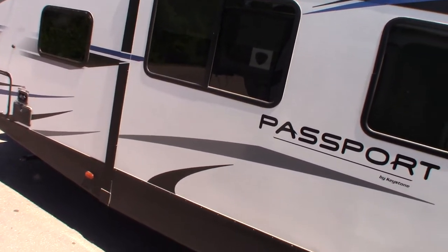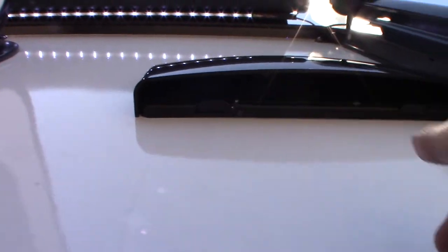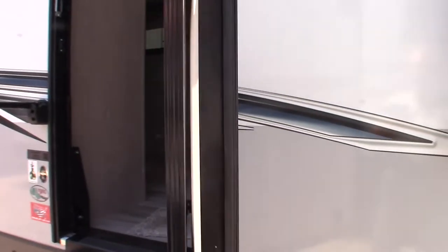There's a range hood right here — it has a fan and a light. This is the vent for the range hood. There's a latch here and a latch here — you always want to push up on those latches so the baffle in there flaps freely when you're venting to the outside. If you're traveling or in storage, you can snap it shut. But anytime you want to run the range hood to clear the kitchen air, you've got to open that baffle so it flaps freely.